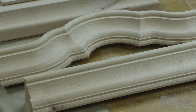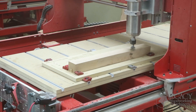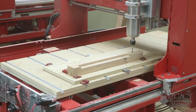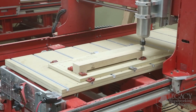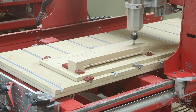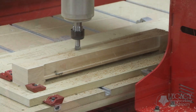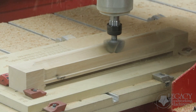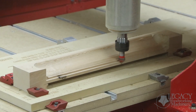Now let's move on to the crown molding, which also has two separate components. We'll start with the straight molding. This is surfaced, receives a rabbet joint, and is drilled in order to flip it over to side two. Once side two is thickness planed, the same milling procedures used in the base molding — that is stacking profile shape cutters — will also be used here in our crown molding. The tools used for this molding are the quarter-inch radius cutter, the two-inch core box cutter, the one-inch barley twist cutter, the 90-degree V cutter, and the two-flute straight cutter.